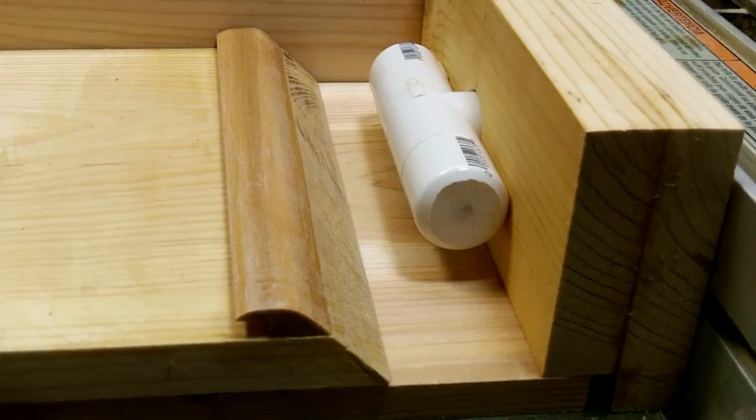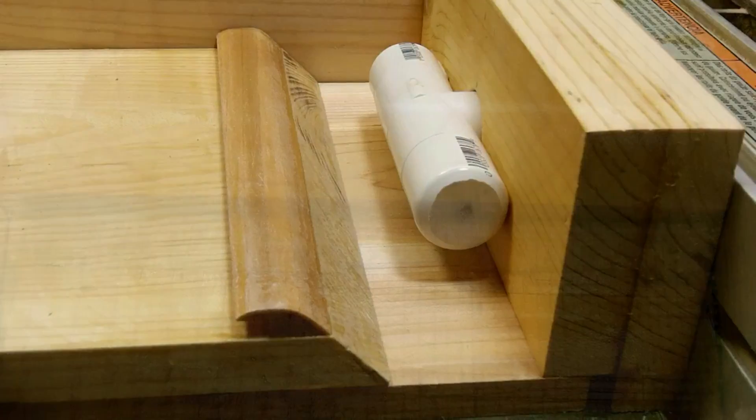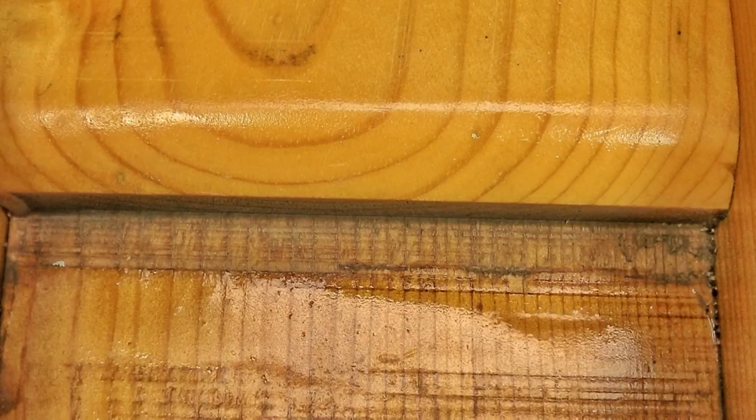With this new design the water bar is buried down into the bottom of a sump or a well, and then the well fills up and overflows over the top, giving a much smoother water flow. As you can see here, I cut a 45-degree angle on this to make the transition a little smoother. I was curious whether a straight up-and-down wall would work as well. On this mini sluice I cut off part of the angle so it was a vertical wall, and it makes a little bit of a difference, but not that bad — especially on a sluice.